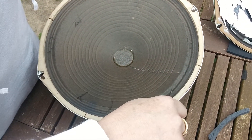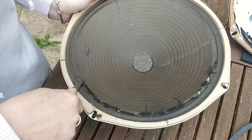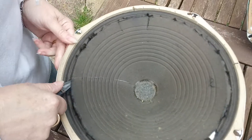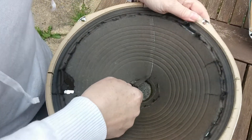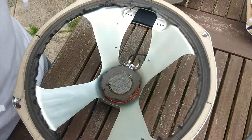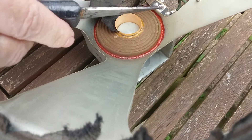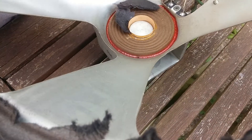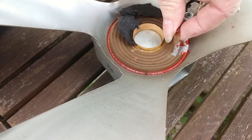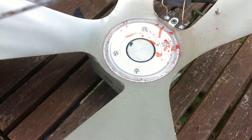Now Shirley's going to give a demonstration of what can happen to the spider in a broken cone — just cutting the cone open. There's a spider under there. You can see how damaged that cone is — this is useless scrap. Even part of the voice coil came off. Now that spider should not tear like that — it's not even glued properly. And what happens so often is people will say the speaker looks fine, but obviously it isn't.